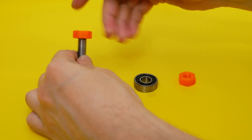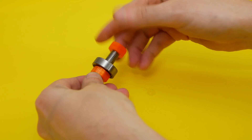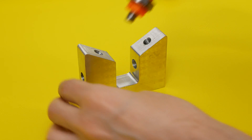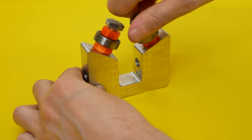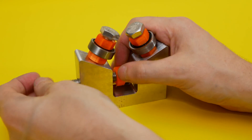You can use metal nuts, but I spend a small fortune on nuts and bolts for all of these projects, so whenever I can use 3D-printed nuts in place of metal nuts, I'm going to. These nuts don't really secure anything — they just act as spacers for the bearings — and that's why I've gone with a 3D-printed version here.